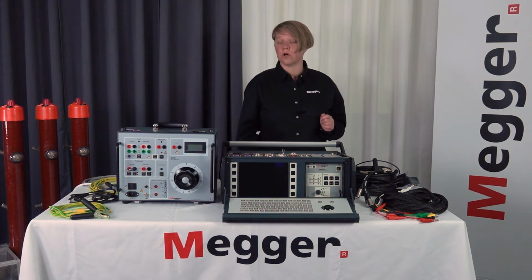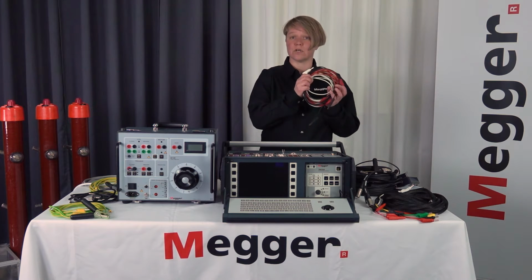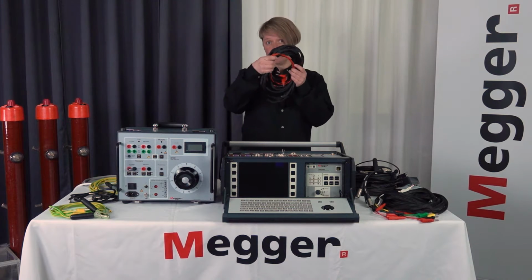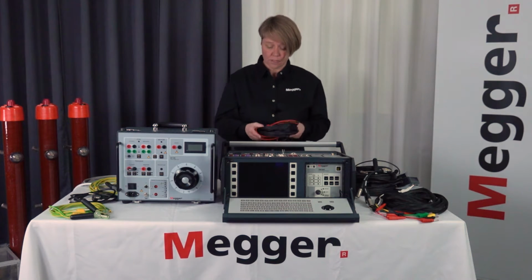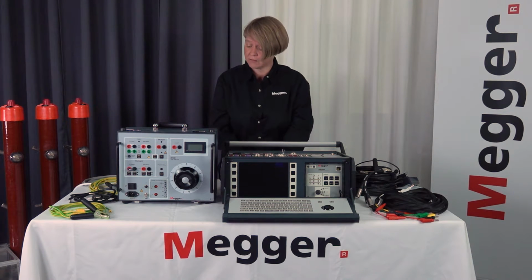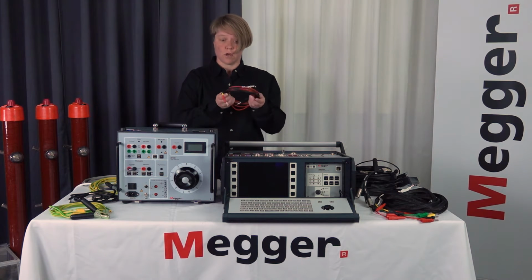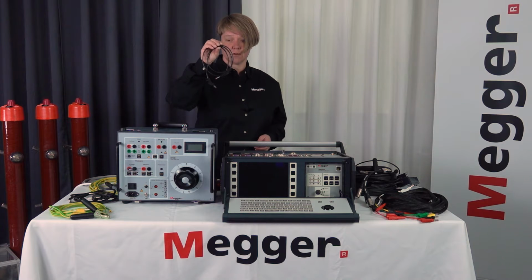But since I'm going to do a dual ground simulation here, I also need cables to short circuit the breaker to simulate the ground. You can use long, normal banana cables or the auxiliary cable for TM1800. Auxiliary timing, because there you have even 4 cables. You need 3 cables. Another thing you need is to charge the motor of a breaker. Then you need a power supply cable there, and you need an extra loop to connect a minus.